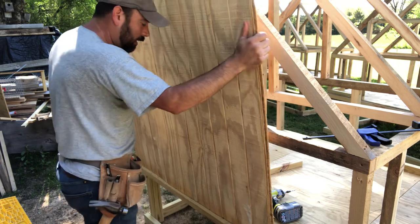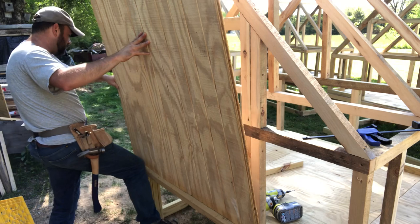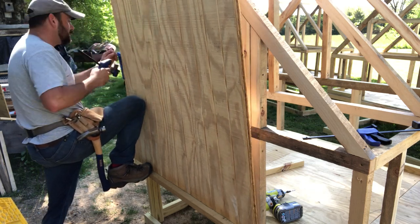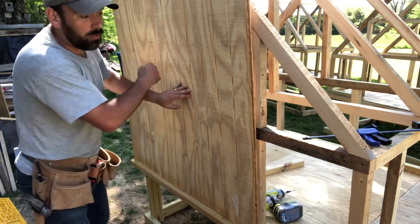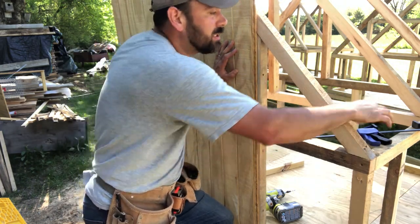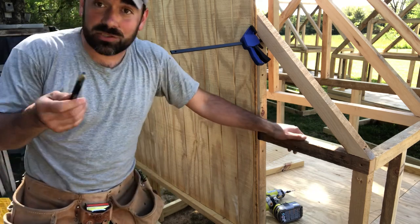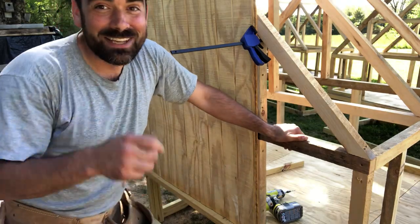Look at this — I've got that lip and it's really helping me out. What I'm doing is taking one edge of this and squaring it up with this side over here. I'm going to use my knee to hold it — no hands, knees holding it. I'm going to get one of these handy clamps and clamp this side down to either the roof rafter or one of the studs. This comes and matches right up with those studs. If this were a windy day I'd be putting clamps at the bottom and doing this fast, but it isn't.